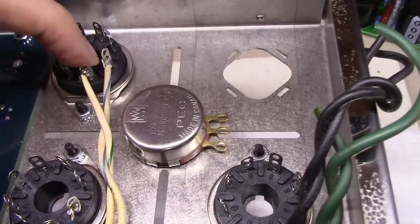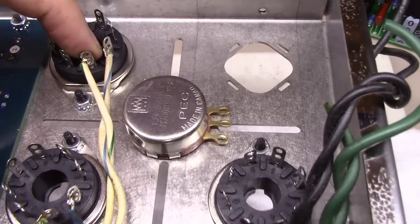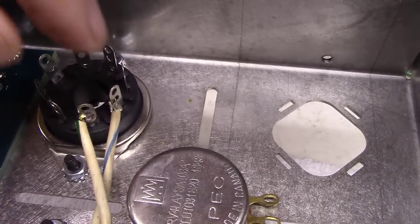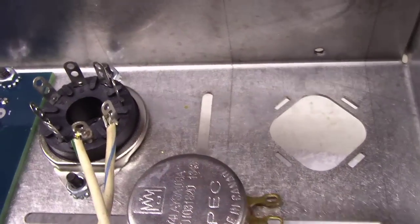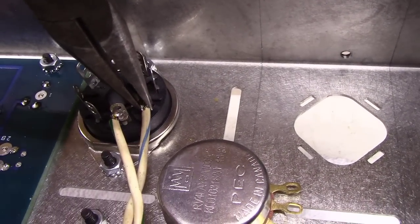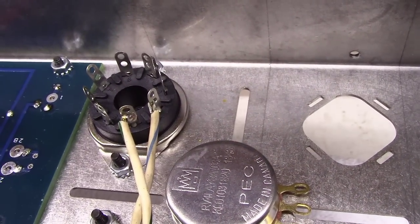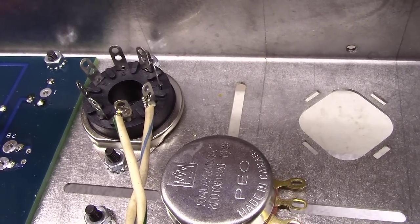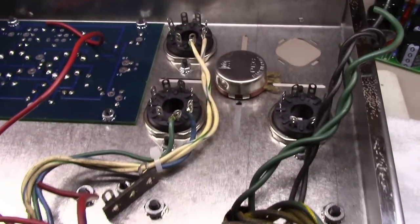And as you can see, I haven't soldered this last one here yet, but you can kind of see I've taken the wire around the loop and bent it all the way around, and then used a pair of pliers kind of like this to close the loop. I always like to make physical connections with wires, not physical connections with solder, but yeah, we'll keep going away at it.